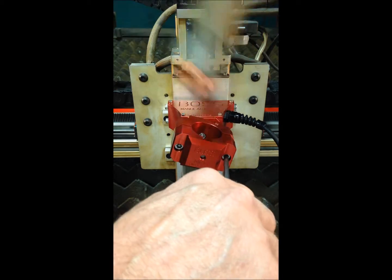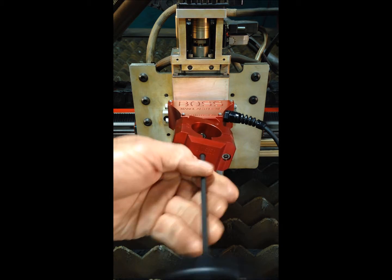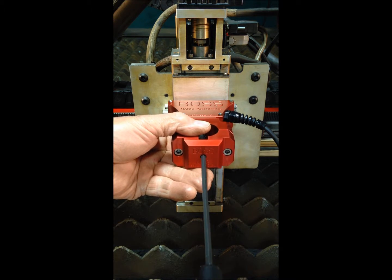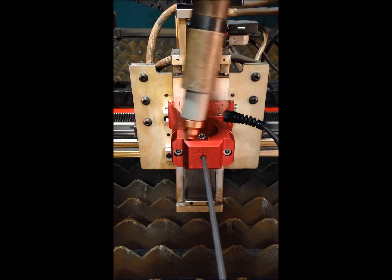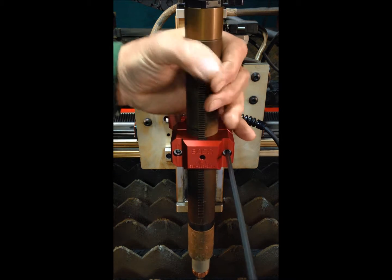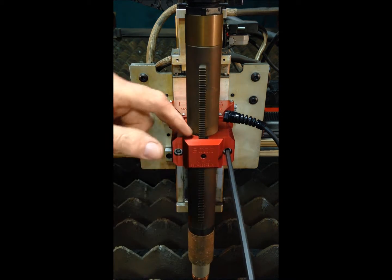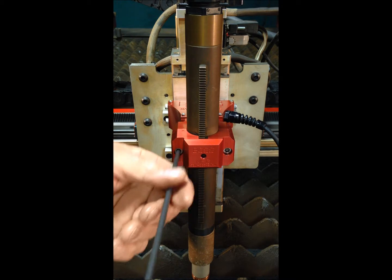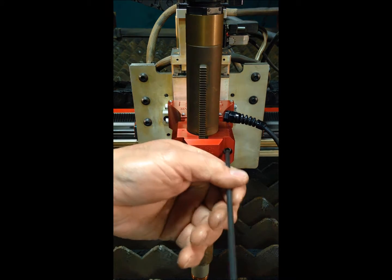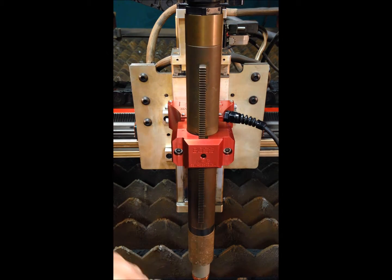To return it is just a reverse of the first procedure. Bring the clamp to vertical position and lock it in. Install the machine torch. I like to put a little sharpie pin mark on my torch barrels — if I'm removing them often, it allows me to always go back to my preferred torch height-to-work distance.